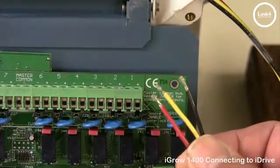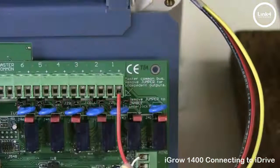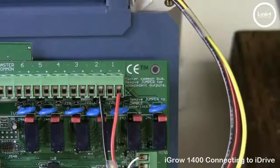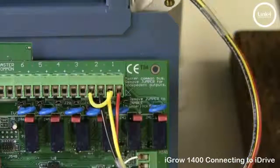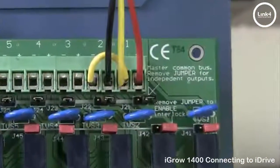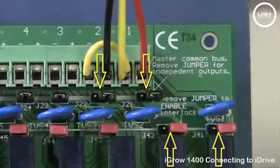For this demonstration, we will use outputs one and two. Plus one will land our open signal wire, plus two will land our closed signal wire, and then we'll install on negative one, jumping to negative two, our 24-volt signal wire. We will also place on one pin the black jumpers J21 and J22 to make this a dry contact application, and put on one pin the red jumpers J41 and J42 to enable the outputs to be interlocked, preventing the outputs from opening and closing at the same time.